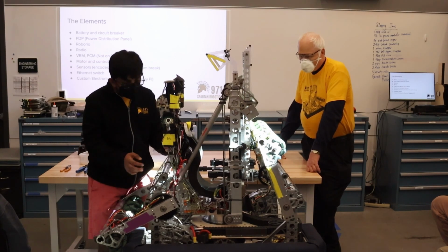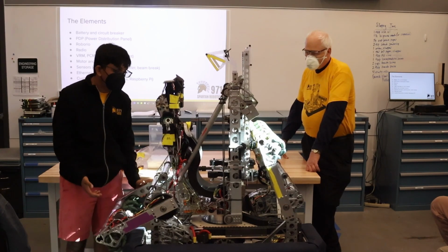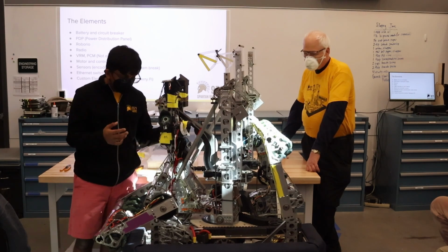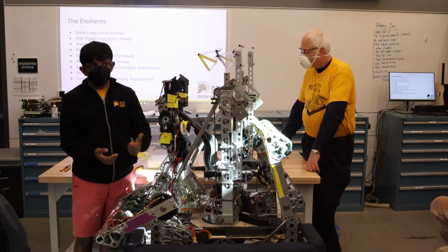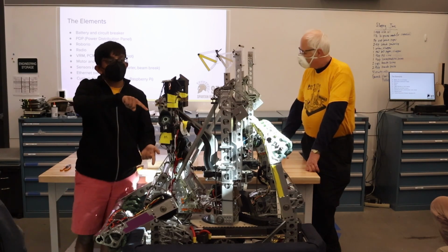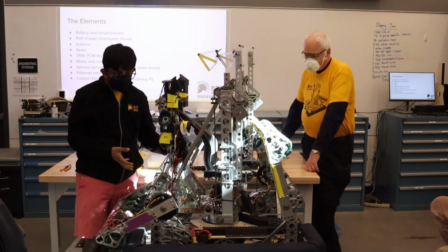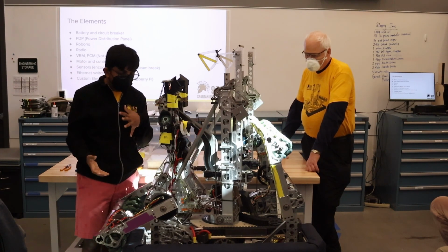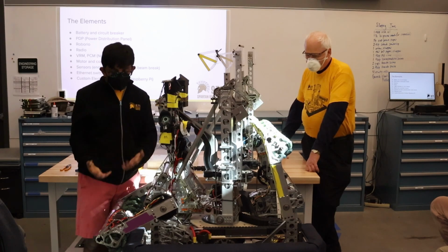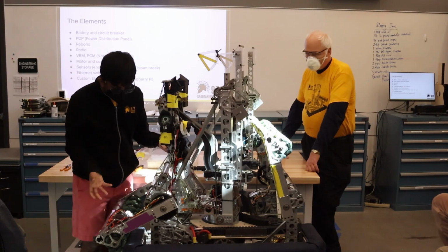And we use a pot and mag encoder combo for any of our zeroed subsystems, like the intake arms or the catapult and the turret. So the pot gives us a 0 to go off of, and due to the way the mag encoder works, it gives us a precise incremental position, which the pot does not. And that sensor combination allows us to know where each subsystem is at a point in time accurately, which our control systems need.